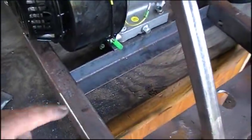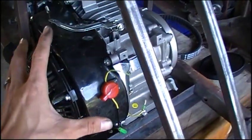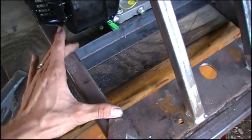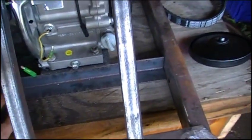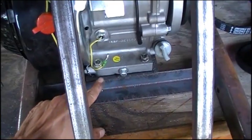The first thing I'm going to have to do here is tack weld this piece of angle iron in here because this moves around right now, and it makes it a real pain in the ass to try to fine tune where this engine placement is because this thing just keeps flopping over. So I'm going to tack weld this into the frame at 6 inches back right there — that's going to be a 6-inch margin — and basically get it so it stays in one spot. Check the measurements on the motor and then maybe tack weld the front of this mounting plate in.